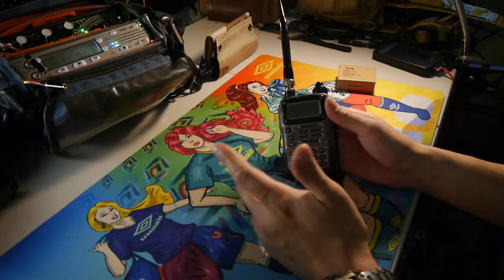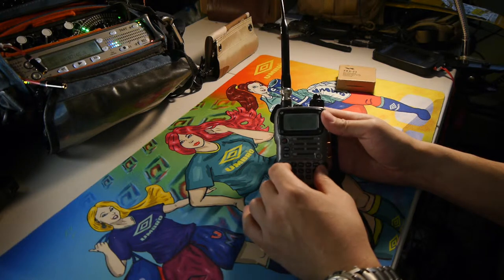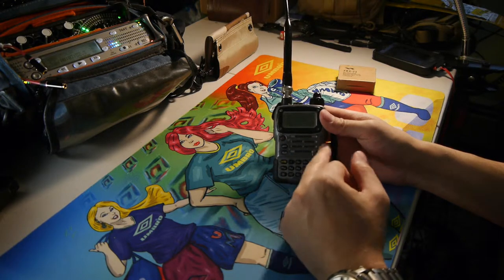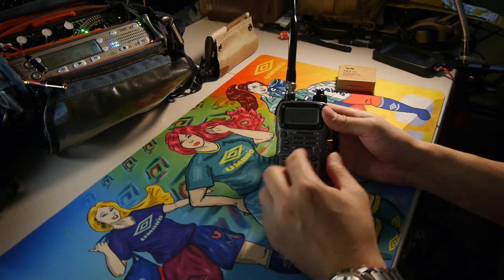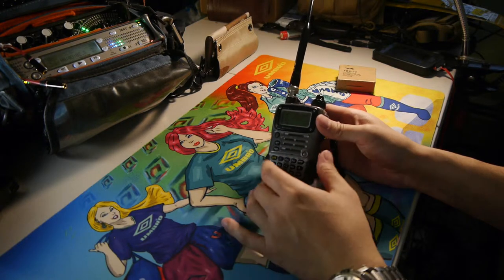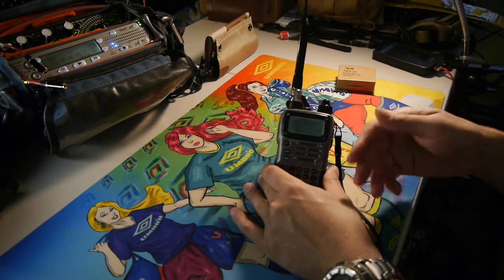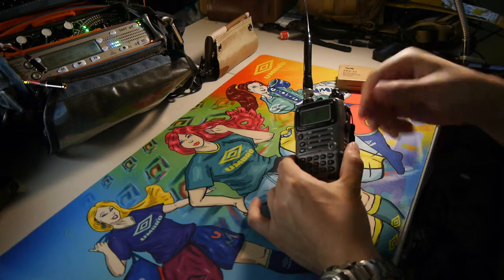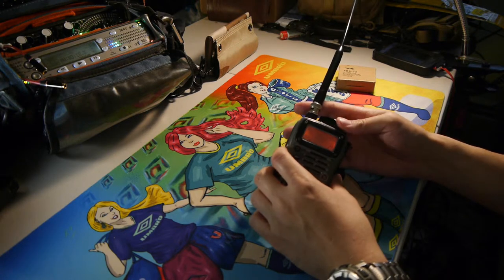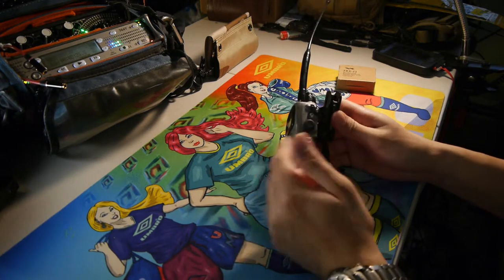Replacement at the Yaesu Repair Center in California is about $343-$349, and I have sent these back. Another con is the ceramic filter inside the radio — it tends to go in these units. It's a commonly known issue. The replacement part is about 49 cents, but parts and labor come to about $35, so with shipping it's about $50 to replace the filter. Or if you're tech savvy, you can take it apart and do some rewiring on the DC capacitor yourself — there are instructions online.